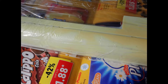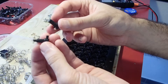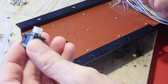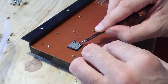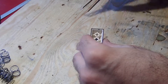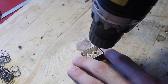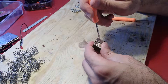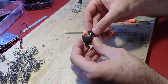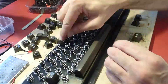During the retro-brighting I turned back to the mainboard — first removing the dust and then cleaning everything with alcohol. Meanwhile I found a replacement for the broken key, and reassembling the keyboard itself went without any issue. One thing I had to deal with: the broken-off shift key still had a plastic piece stuck inside. I couldn't get it out with tweezers or any other tool, so I decided to use a drill and gently clean the hole again by drilling into the broken plastic part. Luckily it worked well. I had to work very carefully because while finding a new key stamp was easy, finding a key cap is nearly impossible. With a little help from my wife and a keyboard layout image, putting the key caps back took just a couple of minutes.